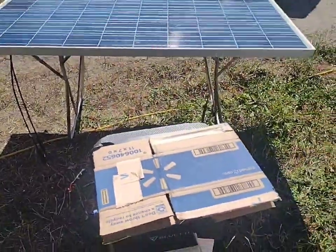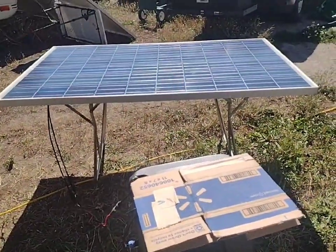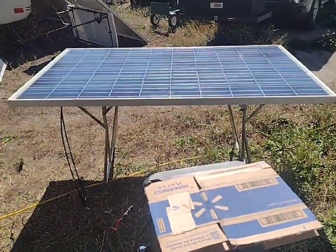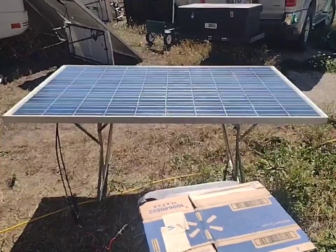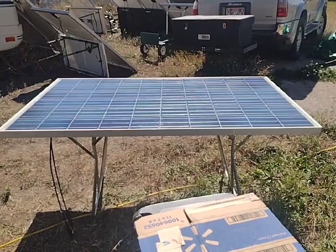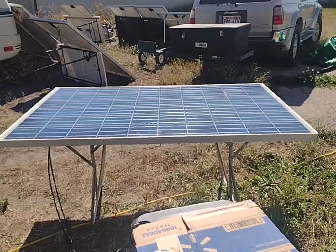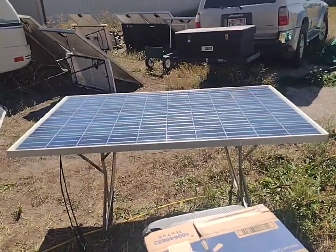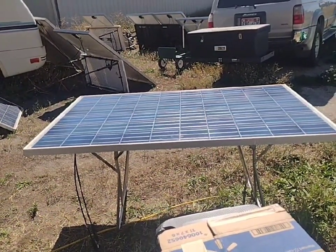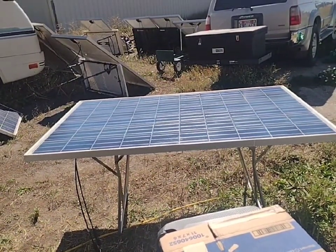That is the testing for today. I've got work ahead of me — cleaning the remaining 26 panels I'm taking down to the ranch. I'm not going to apply coating to all of them; I want to do halfsies. The coating lasts about a year before it comes off, but in the meantime there won't be as much dirt sticking to it. So it'll be a quick clean and reapply each year.